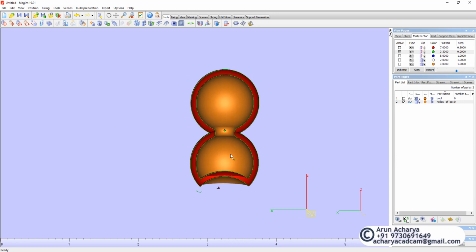resin. For example, if you're working in SolidScape, in SolidScape there are two waxes. One is the pink and one is the blue. The blue is the actual casting wax. So you can use this technique only if you are well experienced in SolidScape. So don't try this hollowing out parts and just keep it for printing. Maybe this will weaken the file itself.